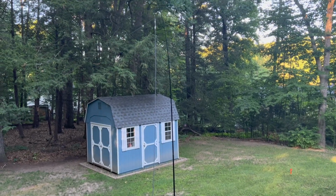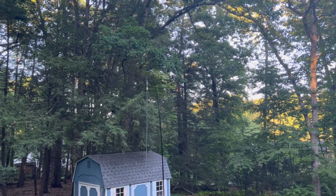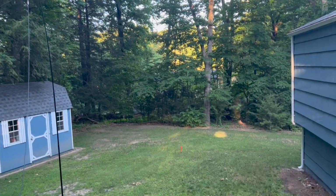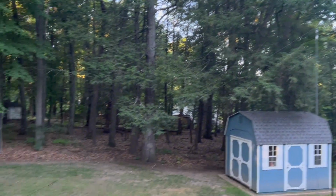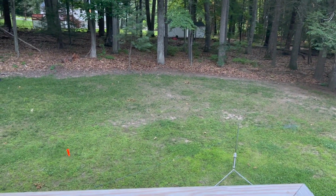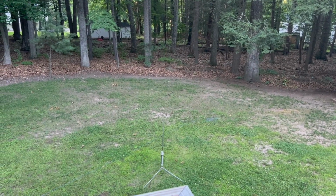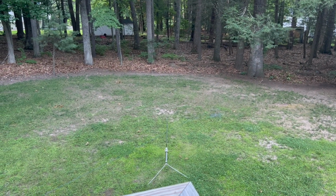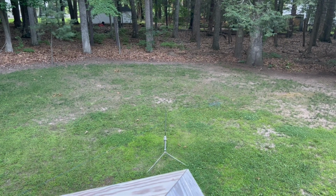Here's the link dipole deployed. The links are in, so I can stay on 40 meters. There's the apex right there. And then we go down to one end where that orange peg is, back up to the center, back down to the orange peg over there. You've seen me deploy this before. You'll notice that I have brought the MFJ 1979 17-foot whip down. I also took the end-fed down, and we'll try that another time.